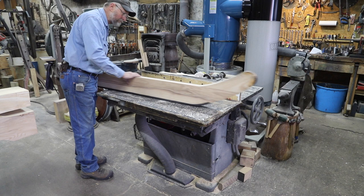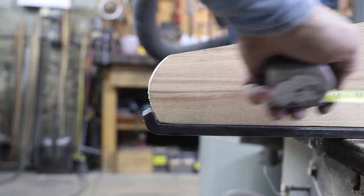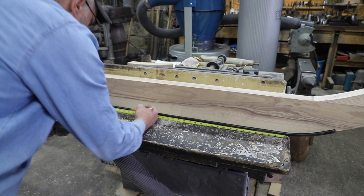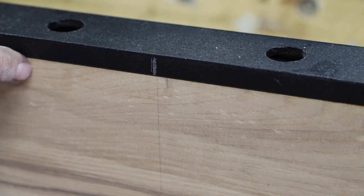So the bridge irons are what actually keep the bunk in place, and the bunk doesn't set in the center of the runner, but it sets in the center of the section that rides on the ground. So this is 54 inch contact on the ground. I'm going to put the bunk at half of that, at the 27 inches. So it looks like it's setting back on the runner, but it's actually in the center where it has contact.